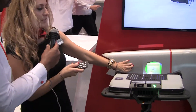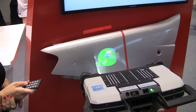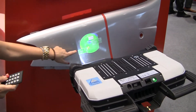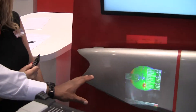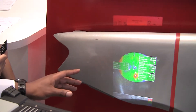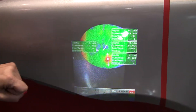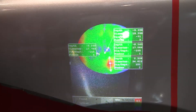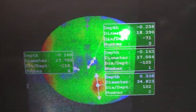It projects directly on the car, and we use it on the airplane as well. After one and a half seconds, you have the results, and you see it here exactly. So the projector actually projects onto the surface and captures the distortions, projecting the results onto it. Yes, exactly — you see the blue and the red colors, which means the bumps come out or in, and you see here the exact parameters.